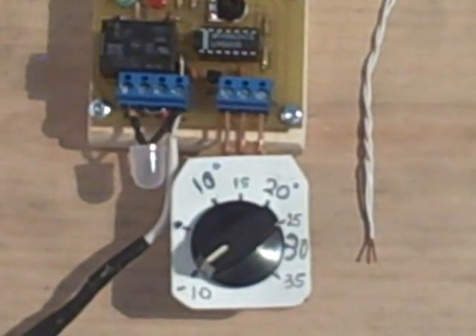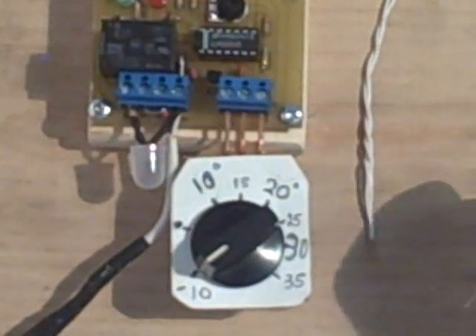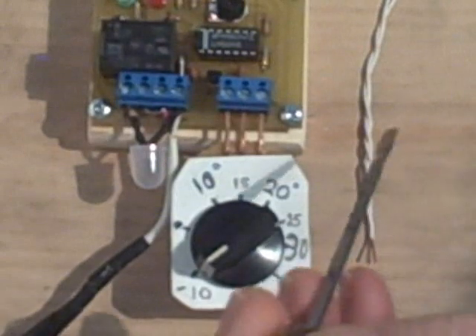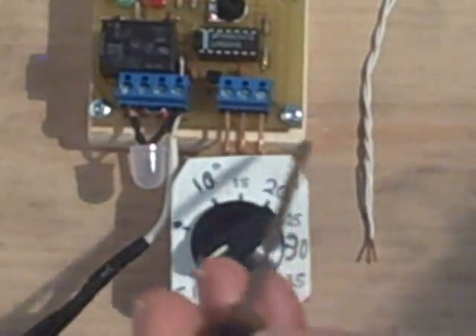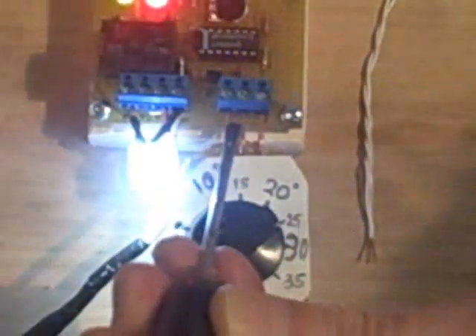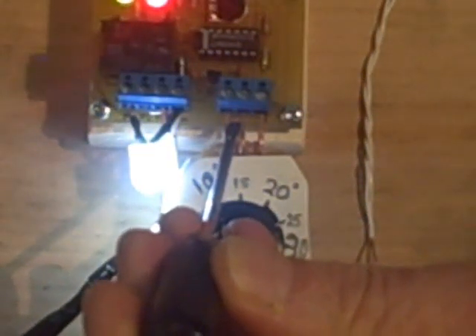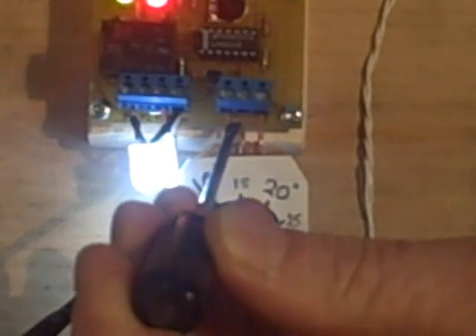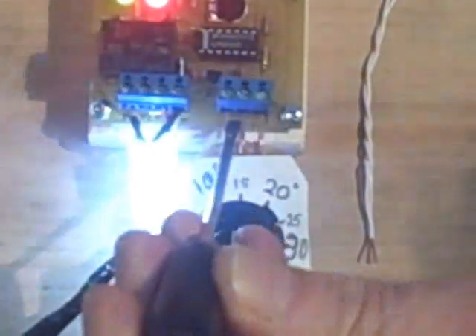So we don't want anything bad to happen. There's a safety feature built into this that limits the amount of current that goes through the probe, done through a voltage regulator. What I'm going to do is short out the collector probe by just putting this screwdriver right on the probes. The 5-volt reference is shorted to the common junction, so it turns the pump on — but you can see there's no damage done to the controller or to the probes.